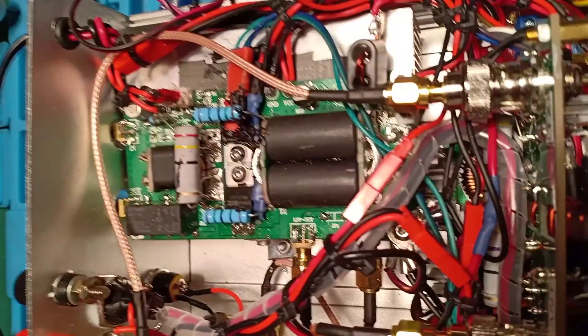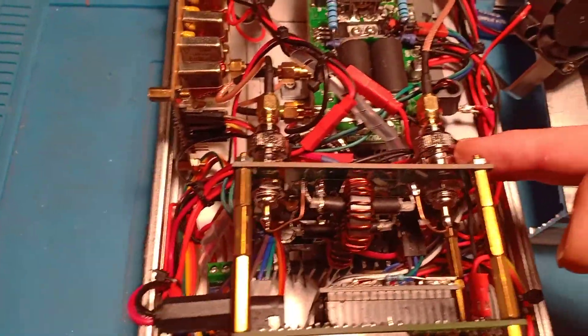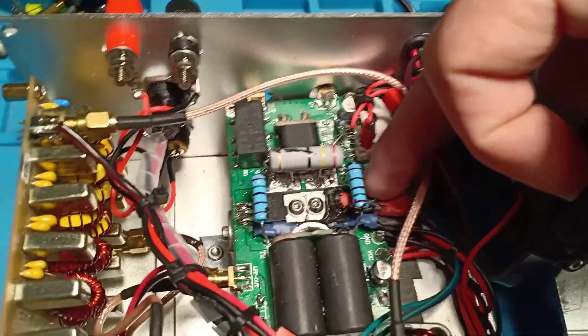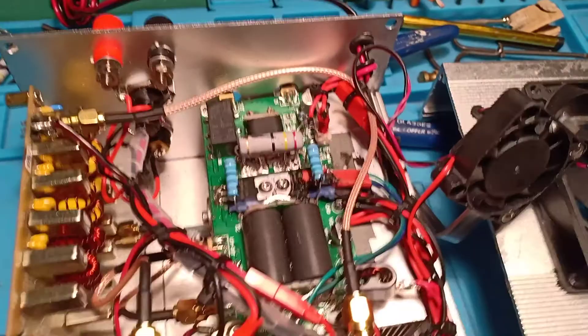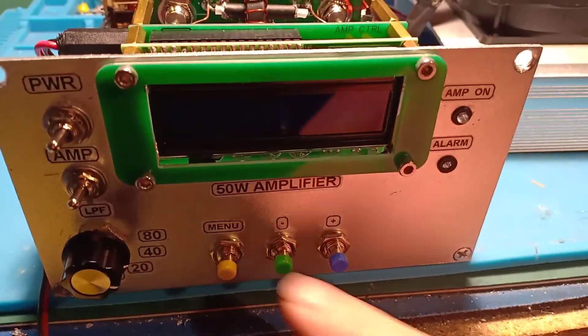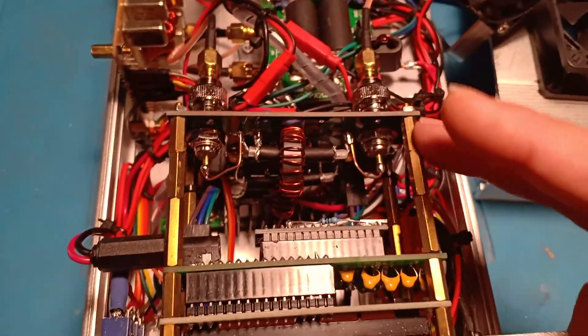Here is the overall controller monitoring SWR, power output, drain current, and temperature. That's why I placed the temperature probe on top of the MOSFET casing — it's very efficient and real-time with minimal latency. Through the menu you can adjust the maximum temperature threshold. I describe how to build it on the web page, including the Arduino sketch and Gerber files.